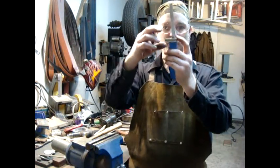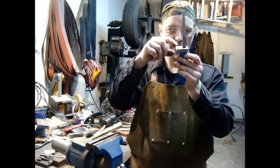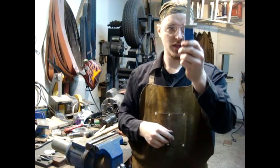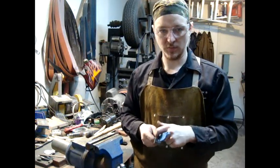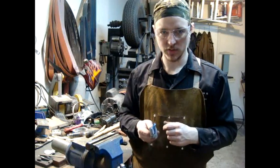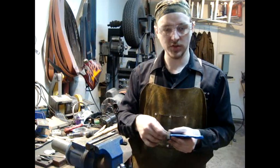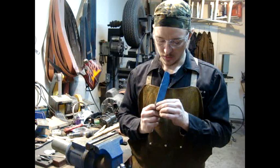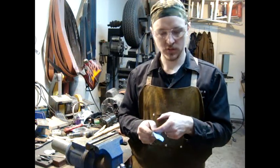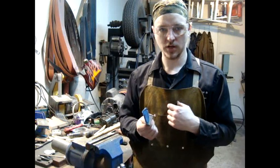This next step I'm going to be soldering all these pieces onto the tang of the knife. That seals any water from getting in between and causing corrosion, eventually seeping into the handle and causing corrosion down here — and basically your handle falls apart after a few years. So it's real critical to seal this area real well. I use a silver solder when I do that.